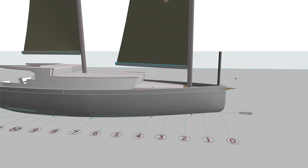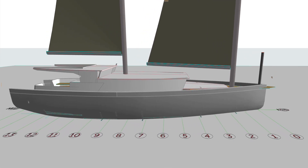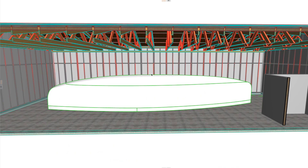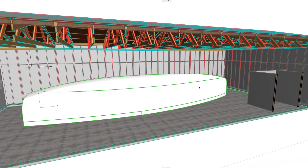Building any building is not straightforward here. The height of the shed makes it prone to wind forces, and in winter you really have to account for the weight of snowfall — even a temporary shed should be structurally sound. How big do I need? It really comes from the measurements of the boat. The boat itself is going to be around 15 meters long and we need extra space to work around it, plus room for the CNC router and other machinery. I concluded the proper size should be around 20 by 10 meters.